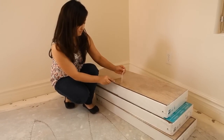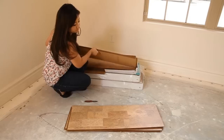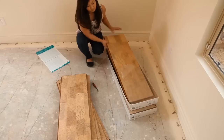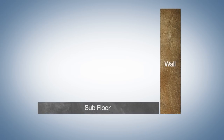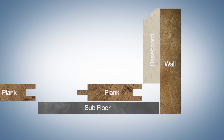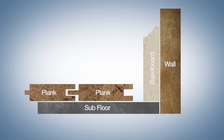Cork flooring arrives in manageable size boxes. We'll want to set aside the contents of the boxes and have them easily accessible for installation. A typical cork flooring installation involves sliding the tiles underneath a base molding, usually leaving about 3 eighths of an inch for expansion and contraction. In this example, we will be installing directly next to the base molding, also leaving a 3 eighths of an inch gap. You can always adhere or nail a quarter round molding to the side of the baseboard to cover up the gap against the wall. It's really up to you as far as your preference and style.